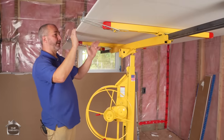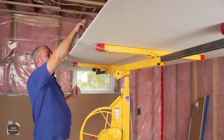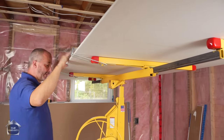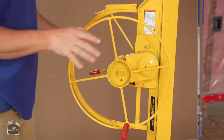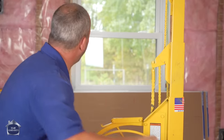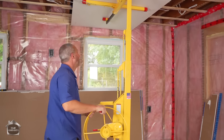Now, let's just recap. We've got our drywall, we've got it cut, we've got it measured, we know it's square in the room, we're going about 44 inches off. The fixture we're gonna cut out is written on the wall. So in reality, this drywall can go pretty much anywhere within a few inches, right? As long as it fits in the hole, it doesn't matter where it lands, we're gonna be just fine. This is the benefit of my system. You don't have to be perfect in your location. You just wanna get it roughly in the area. Keep an eye on things, try to keep them relatively square, all right, boom, boom, boom.